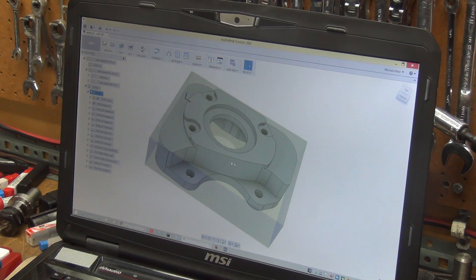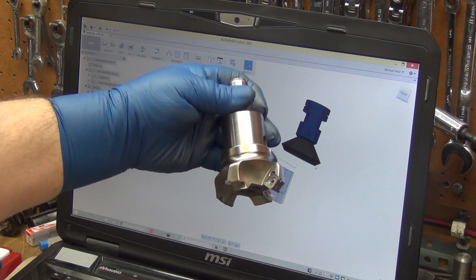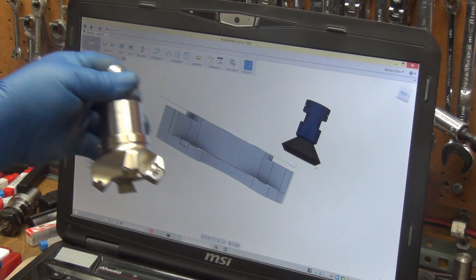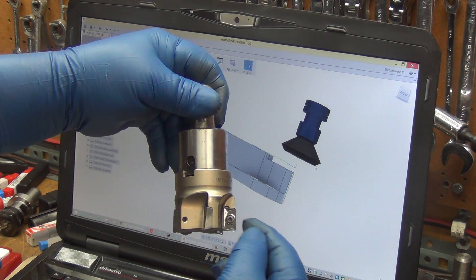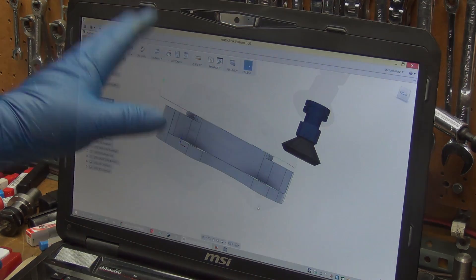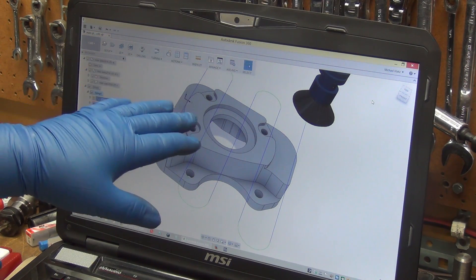There's a yellow warning here telling me I have this modeled as a chamfer tool — that's the only way I could get it to be semi-accurate, to have my width all the way out on the side in case I'm coming up against something, while still only having my two-inch cutting depth at the bottom. If I set it up as a face mill it doesn't account for that extra sticking out on the side. The warning says the chamfer tool is selected — and yes, I want to go with it. Instead of going left and right — because I think I have a bit of nod on the machine and end up with a little ridge between passes — I'll try it at 90 degrees.